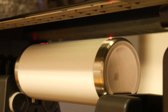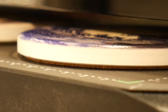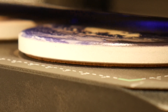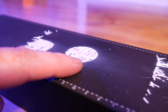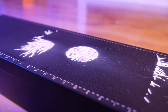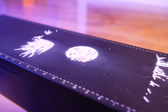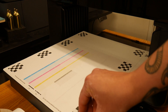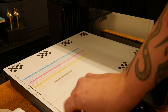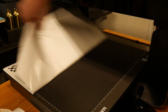Before printing, the machine will use a set of lasers to determine the height of your object, but the object must be flat with a height variation of under 2 mm. Both flatbeds use sheets with a light reusable adhesive to keep your media flat and secure, but those will lose grip over time, especially as overspray builds up on them. When you replace an adhesive sheet, the machine prints grids on the protective paper cover to calibrate the built-in overhead camera. Once that's done, you can remove the paper and start printing.